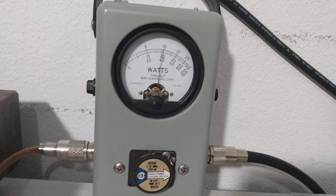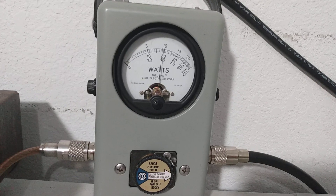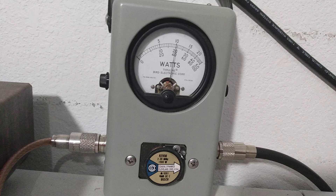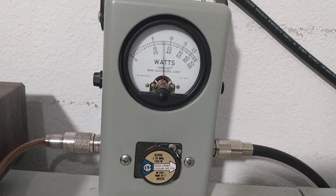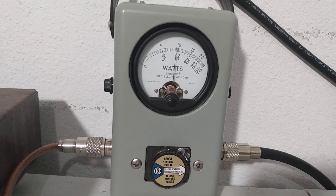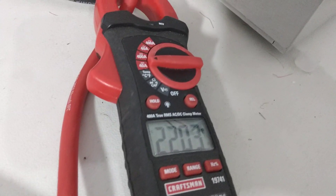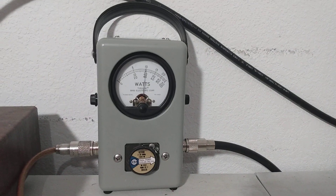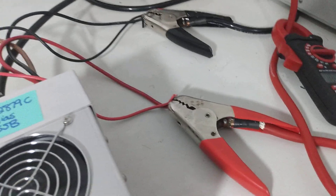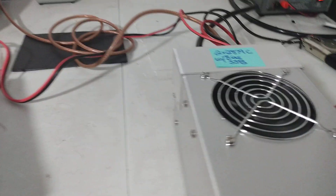That's right in the parameters you want to see them do. For the longest time every one I got in did about 390 to 400, then I had a couple that would do 425 to 430. But 400 watts PEP ballpark and around 200 average give or take — that's a good running amp. Staying on the key just talking to the mic to show what it draws, and again that's on 15 volts, probably not even a full 15 — measured at the jumpers it's probably like 14.8 or something like that.